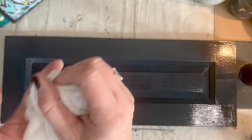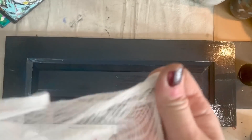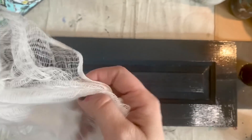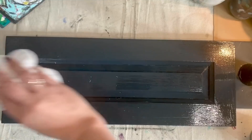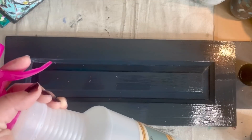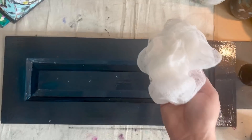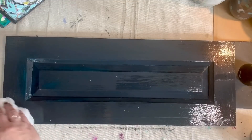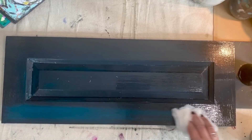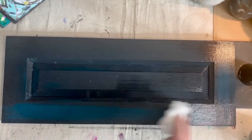Always cut a little bit of your cheesecloth — I always say just like a snowball in your hand — and I like to spread it out, open it up. All these lines will give you beautiful lines when you swipe off your glaze. Very gently, not tightly — it looks like a loofah, right? It's very, very soft to the touch to be able to wipe it off. Before we do that though, let's spray a little bit of water on top of our cheesecloth. Spritz, spritz, spritz — maybe a little bit more damp. And now we start to wipe. Let's go ahead and wipe the glaze off. Remember, the longer I leave it on here, the darker it's going to get — so that part is up to you.